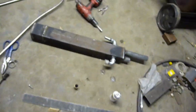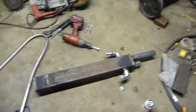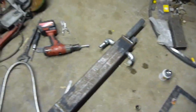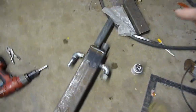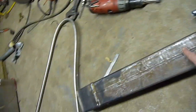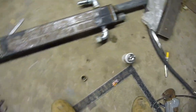Here's my heat exchanger. In my mind it was going to go a whole lot different from this, but I just made it out of what I had laying around. It looks like a four by three inch piece of tubing. Gas comes in here — exhaust gas comes in here, comes down, goes through this chamber down here, comes back out. It's a double pass.